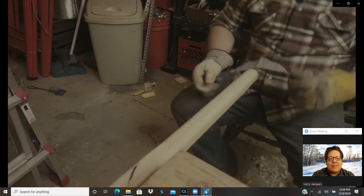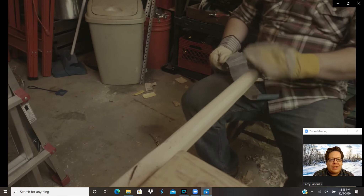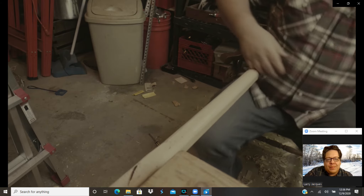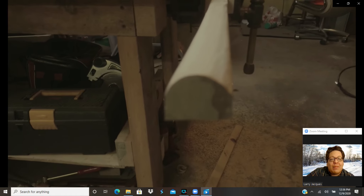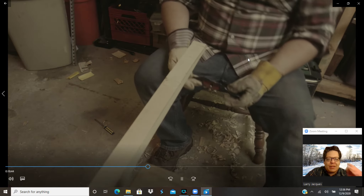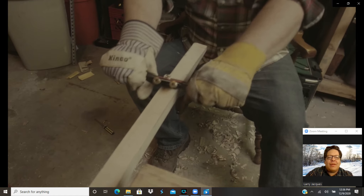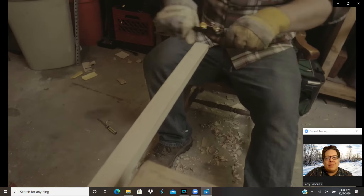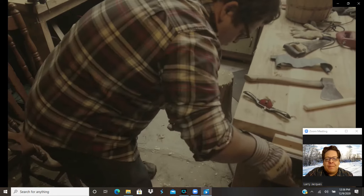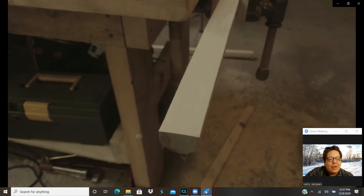If you use some sandpaper when you're eyeing things up, it takes off some of the edges and lets you get a real good look at how it's turning out. That's a much more symmetrical looking back end of the snow snake. Now I've flipped the snake around in the vise, and we have the front chin of the snake — that's where we're removing some material. This actually goes pretty quickly. Putting my foot on the bench to get some good strong pulls, and that got smooth in a very short amount of time. That side is pretty much ready to go for sanding.